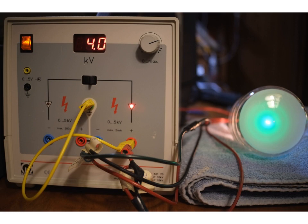We use the voltage to control how fast the electron beam goes. It also has the side effect of changing the brightness of the pattern. I have the voltage pretty high right now. I have it on 4 kilovolts. That's somewhere in the range where the tube is designed to be used. It makes a nice bright diffraction pattern that's easy to see even with the lights in the room on.